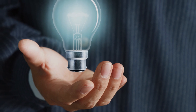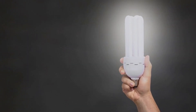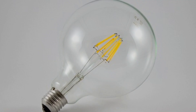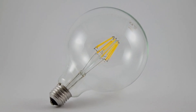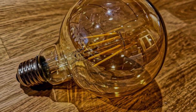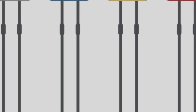If you try using a traditional 110 volts incandescent light bulb in a 220 volts socket, here's what could happen. First, the overheating hazard: when you use a 110 volts incandescent bulb in a 220 volts socket, it will draw more current than it was designed for. This increased current flow will lead to excessive heat buildup within the bulb, which can be dangerous and even result in a potential fire hazard.